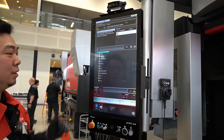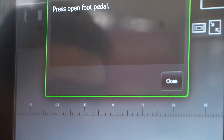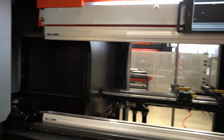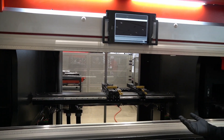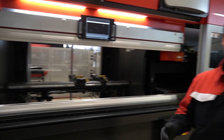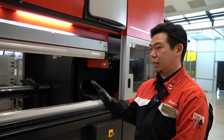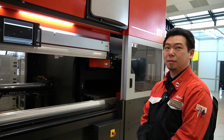That is cool. I will start the machine, go to the setup, and open and close the foot pedal. Right now what I am doing is originating the machine. This should be done first thing in the morning whenever you turn the machine on. If you do it once a day, that's enough. You're basically doing a soft reboot of the machine.